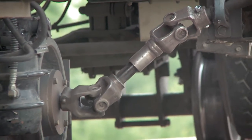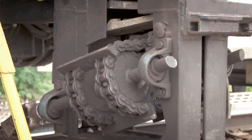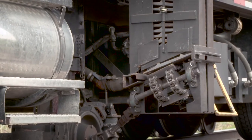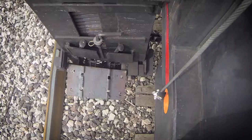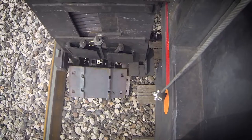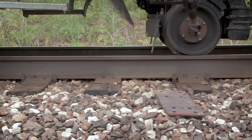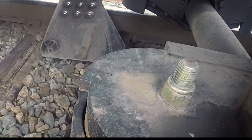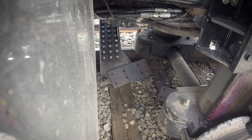The connecting PTO shaft spins a chain drive, pushing plates from the magazine and causing each one to fall upside down every 19.5 inches. And if laying plates to the center of the track is preferred, Genesis Rail Trucks can easily accomplish this, both single or dual and with additional or removable slides.